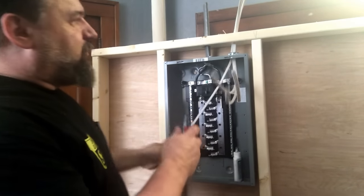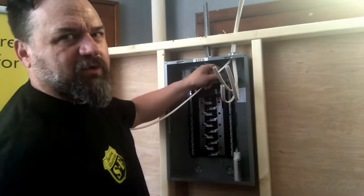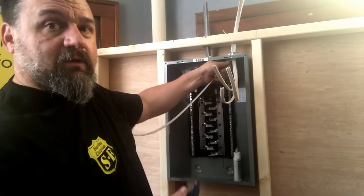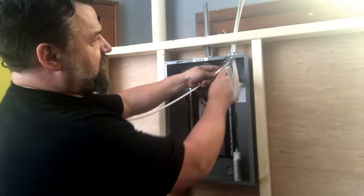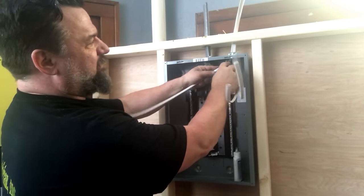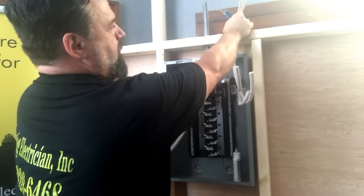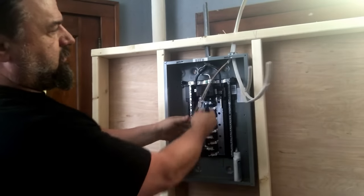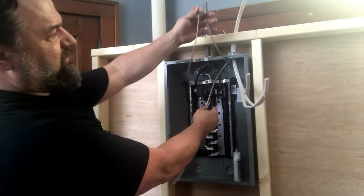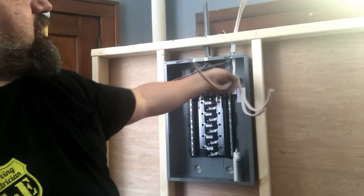We're not gonna go into a bunch of different wire sizing. Again, that's gonna be a little classroom talk. We're doing a little theory. There's brains with this good looks too. So we're gonna do the same thing with these, but with these, be very careful. Score it very lightly, and then it pulls off. See that? You pull it down, push up on that insulation, that paper, and it pops off. We're gonna do it to all four.